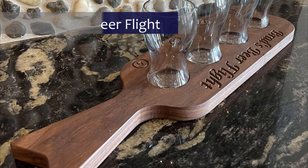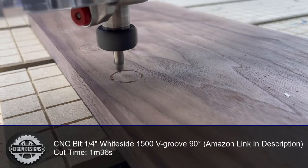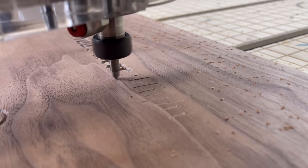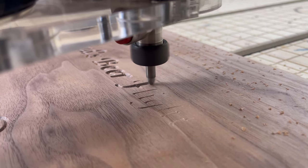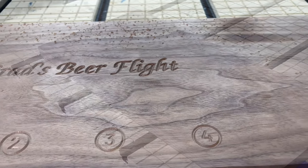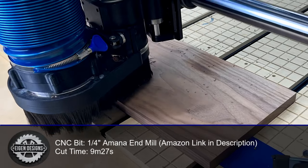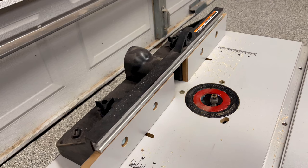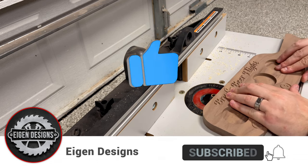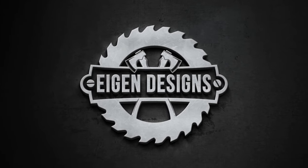Next up, I'm going to be making a craft beer flight designed to work with glasses I got from Amazon. I'll skip the design overview and hop straight into the carving. We start with a 90-degree engraving bit that will outline numbers one through four underneath each of the beer glasses so you can identify which glass is which. There's also some text at the top — this board was made for Brad, so it says Brad's Beer Flight, but on the plans it'll just say Beer Flight. Then it's time to do the actual cup cutout accommodating the glasses, followed by a contour cutout. I went through a few different versions to find high-quality glass that was actually glass, not plastic, so I have an Amazon link in the description.